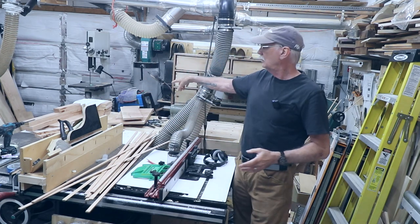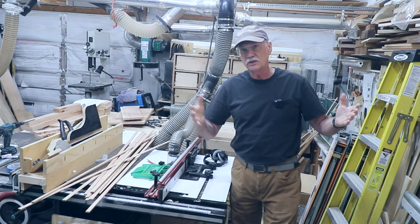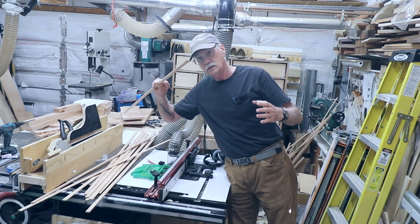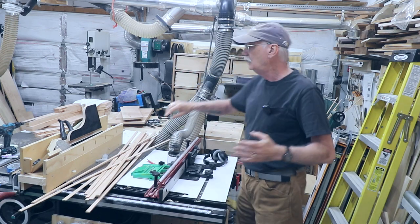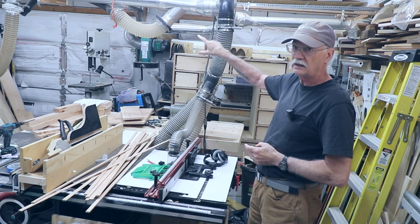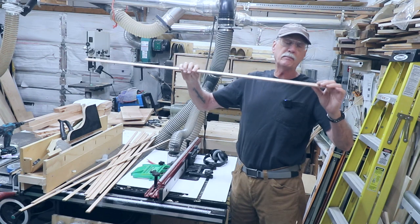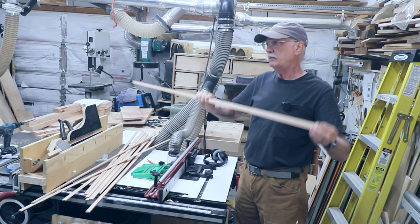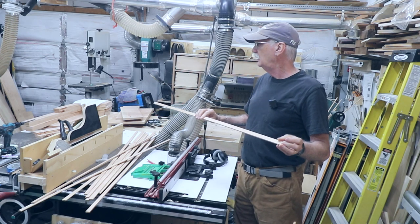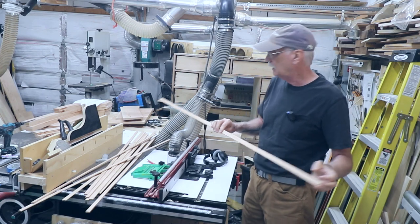The thing is, these drawer fronts are made oversized. Not smaller, oversized. And I need to trim each one to a size plus the quarter inch piece of bead detail to go into each slot where each box where the drawers are, and then fasten them to the drawers. And these, of course, are going to be mitered in place, so that's finicky bits. I've got a little tiny model maker's miter box, but it was very cheap and it doesn't work very well. So I probably will wind up doing these on the shop saw, which means a lot of sneaking up.